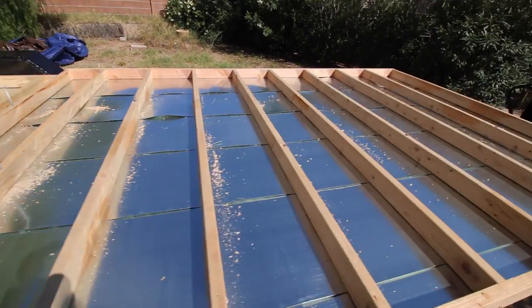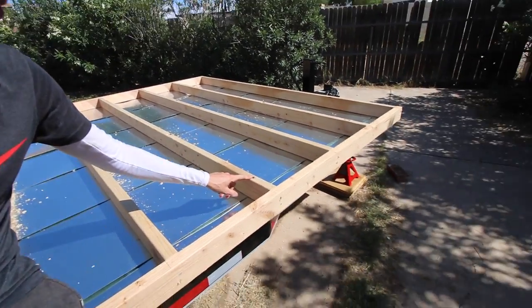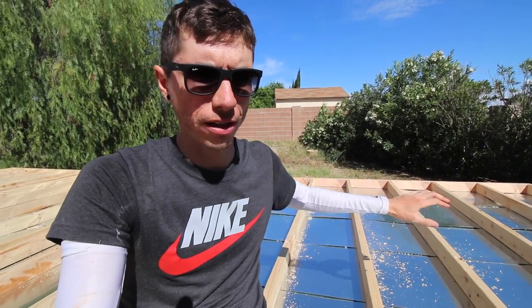All right baby, she is looking good. So I got 6-inch bolts to go through the 2x4s into the flange there. 6 inches is way too long. I don't think they sell 4.5-inch, but if they don't, then I'll just get 5-inch bolts. And the 1/2-inch bit that I was using to drill through the metal down there has gotten completely dull, so I'm going to have to get another 1/2-inch drill bit to finish drilling through the runner beams on this side. Then I'll be back tomorrow and I'm going to start installing the insulation in the cavities here, and then I can finally put the subfloor on.